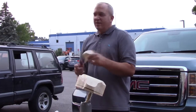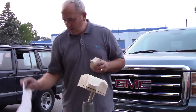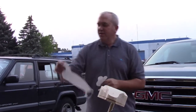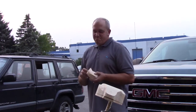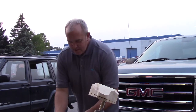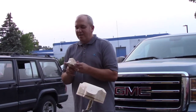One thing, the head, you'll notice, I've got three patterns. I've got the top, the front, and the side. Now the key to this is a good bandsaw, a good bandsaw blade, and watching where your fingers are. If you're very confident with your bandsaw, it's a nice trick. You can save a lot of time, remove a lot of wood. And so what I do is get a square block of wood. Make sure it's square, otherwise it's not going to work.